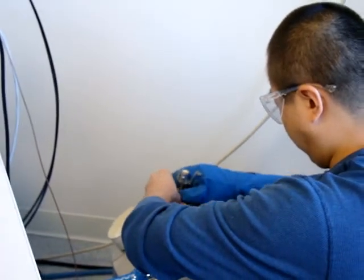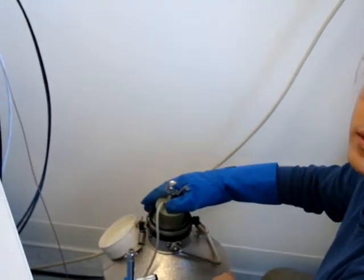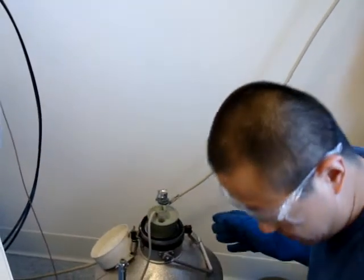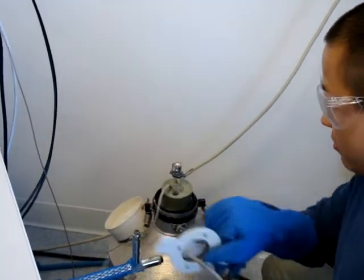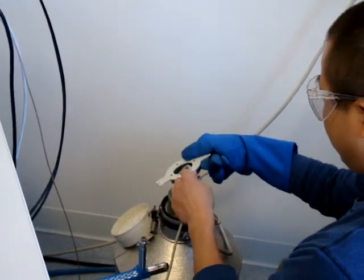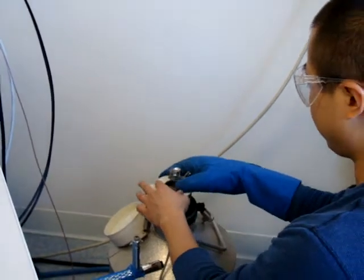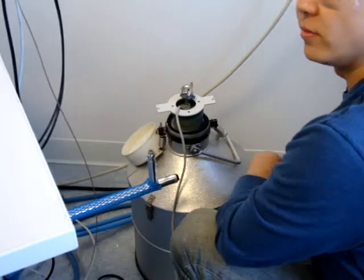That could get salty. And you can dip your hand in the nitrogen if you want to. I don't want to do that and lose two fingers. It's so cold relative to how hot you are. It has the same effect as a drop of water on a hot skillet: it floats around for a minute, instantly forming a gas barrier between you and the liquid, so it doesn't actually touch you. Once you cool down and it touches you, you have serious problems. But the gases, you've got to be worried about the gases.